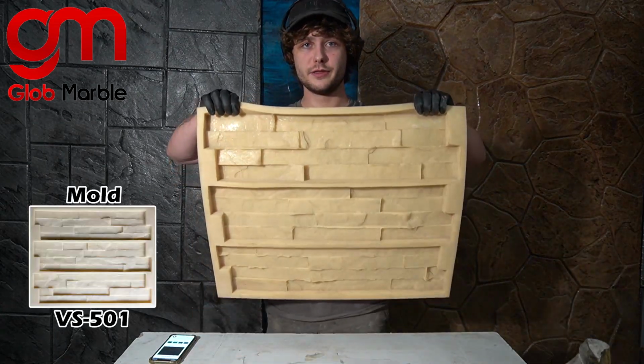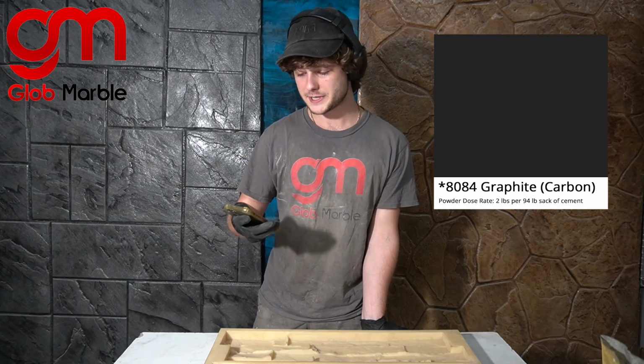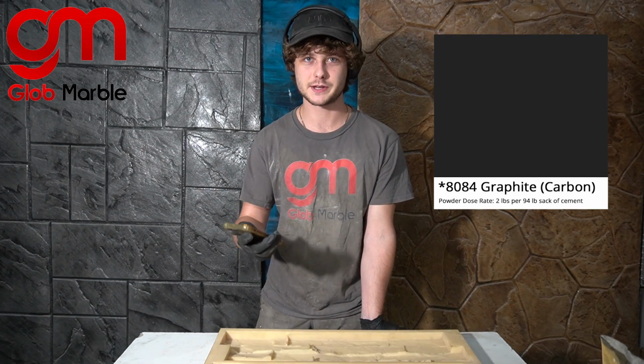And also, depending on how much of it you add, you're going to get a different shade. One thing to keep in mind with this though is that the more of it you add, the weaker your concrete's going to become. The recommended doses on our website won't really change it that much, but anything over that I wouldn't really recommend. I'm going to be casting this mold with our 8084 pigment, which is a black pigment. The website says that I need 2 pounds per 94 pound bag of cement to get the color graphite, so that's what I'm going to be doing.